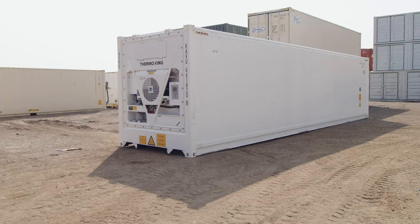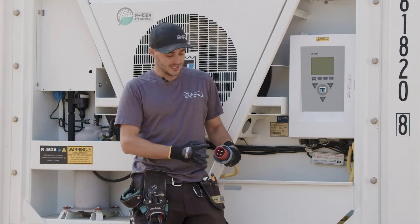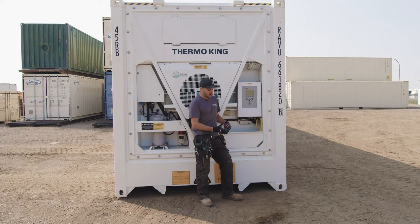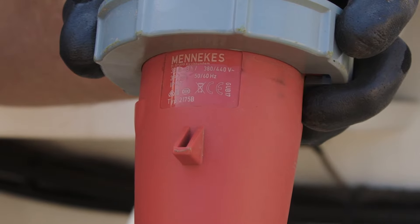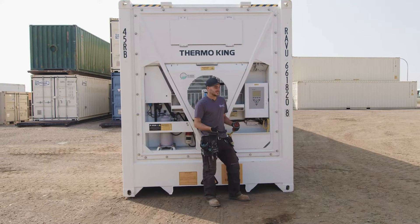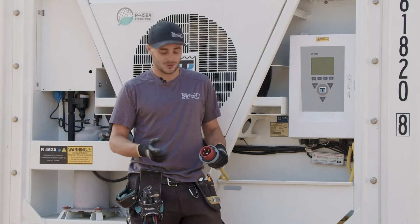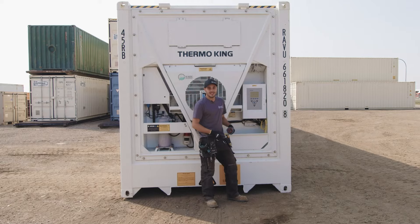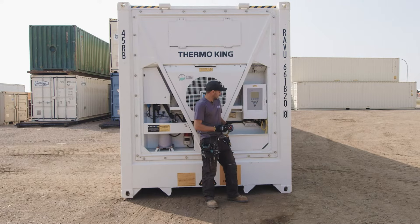These plugs are meant to plug into container ships, where diesel engines provide power to run multiple containers. Around home it's 460-volt three-phase power that you need to operate this unit. They do have inverters as an optional kit that will allow it to plug into different voltages of three-phase, and I think - don't quote me - they might have a 240-volt single-phase option, which would be really cool because then anybody with enough household amperage could plug this thing in.